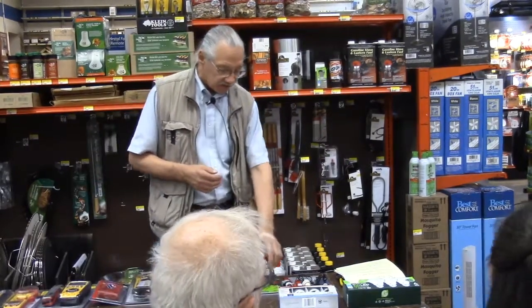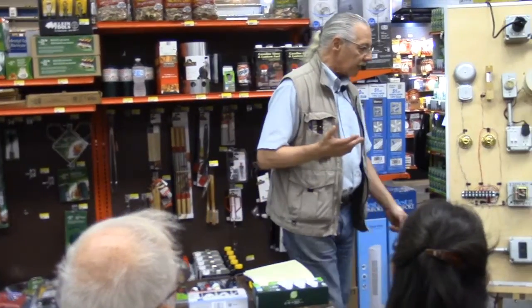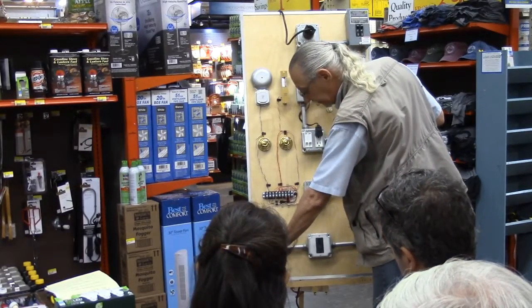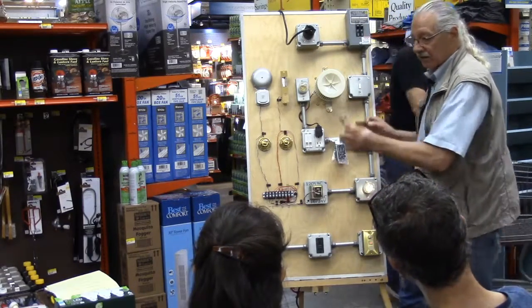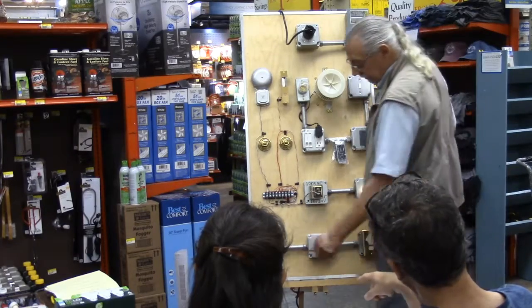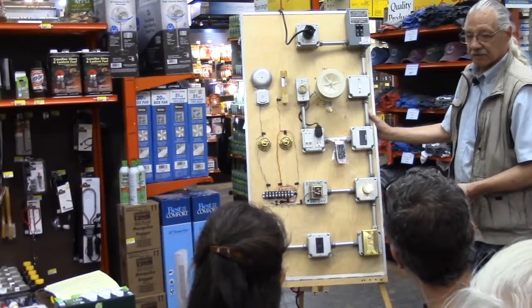Let's get to the uses of some of these instruments. A simple non-contact tester — there are many brands on the market and we have four different ones here. All it does is tell us if we have power. Without taking the outlets out of the circuit to get to the wires, I've just confirmed that those are hot. You have to put it into the hot side — that's the neutral, it's not going to beep. So it can even differentiate neutral and hot because it won't beep on the neutral side, just the hot side.